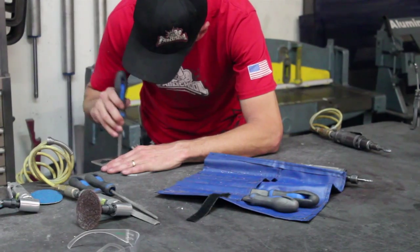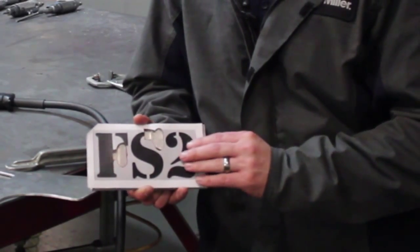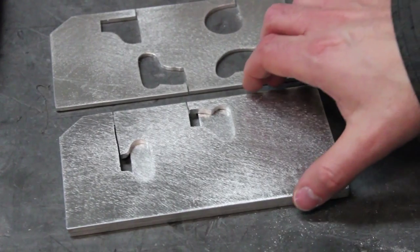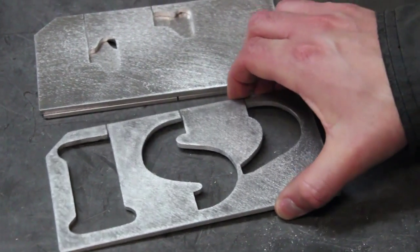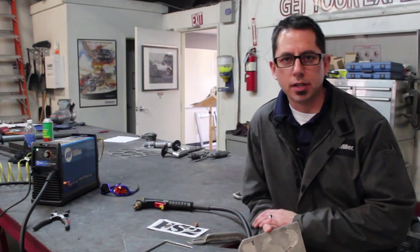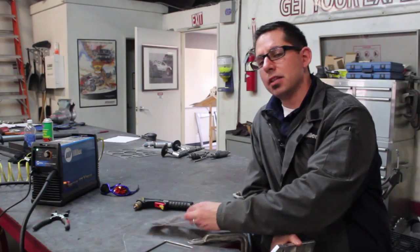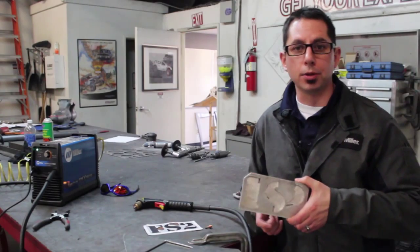What's unique about this project is the way they're creating the templates to create essentially this inset of the shock tower mount. You can see right here we've got some of the cutouts already made in this piece of paper, and there's a reason for that. There's going to be a progression they're going to use on the different templates. Not only are the guys here at the Fab School cutting out the shape of the shock tower mount itself, they're actually cutting this stencil into the piece, and the way they're doing that is with a stepped template.